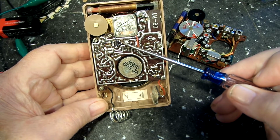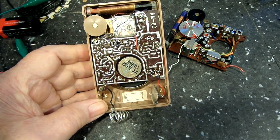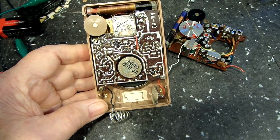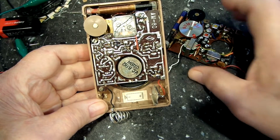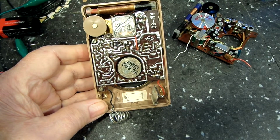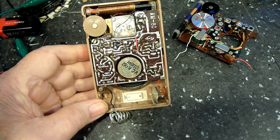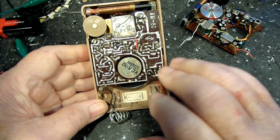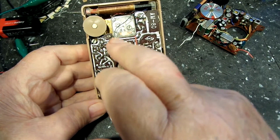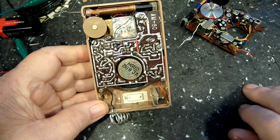I could put the 455 modulated signal there, and it would work. If I put it on the base, it did not work. So it was not getting through. Obviously that's usually, I say obviously, it could have been voltage, but I believe I did check the voltage. But anyway, I pulled the transistor out and decided, being as the other one worked, I would use the mixer oscillator transistor out of that, and by gosh, I did that, and this one magically started working.